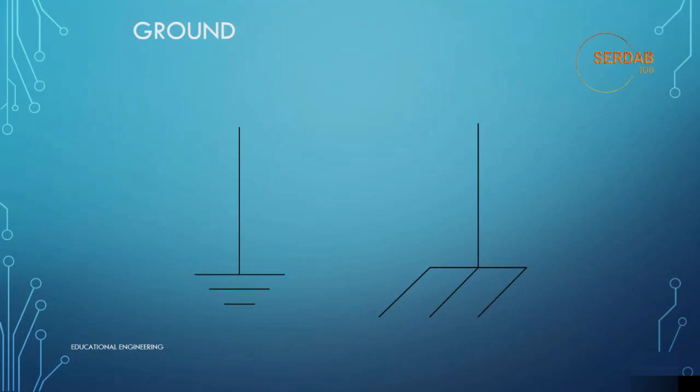The term grounding probably comes from the safety term related to connecting an electric device to a metal rod driven into the earth to provide a safety path for stray current to flow into the earth, and not through the operator's body. For instance, many high structures have lightning rods that are hooked to grounding rods driven into the earth so that in the event of a lightning strike, the dangerous voltage and current from the lightning strike flow harmlessly into the earth and not through humans in the place.